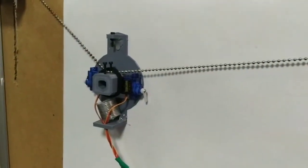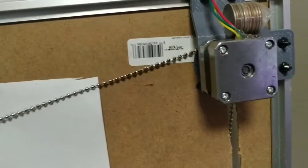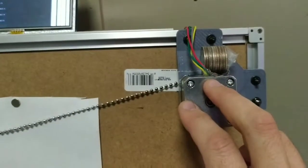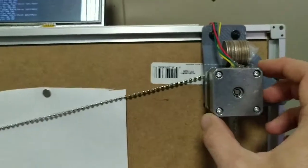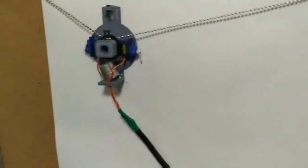We actually just missed the servos dropping, but anyways, the servos dropped the gondola, so now the thing would be drawing. Screen is printing something about the data. So the Adafruit people tried to maximize holding torque by energizing both coils at once. But the problem is that that resulted in way too much power dissipation. That's almost half an amp being dissipated in this little square. So these steppers would get really hot, and what that would result in is eventually losing steps, probably due to current drop due to resistive high temperatures. Alright, so there's a whole bunch of other cool plots on the GitHub.